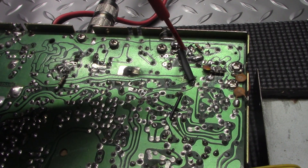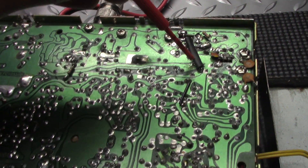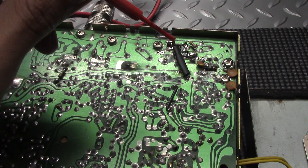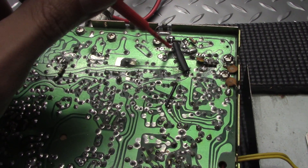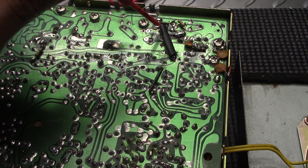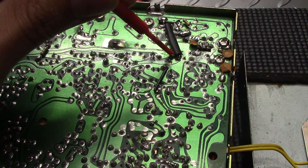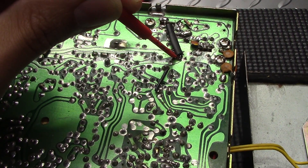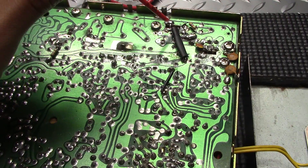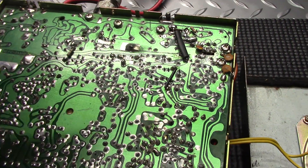If you're seeing like one watt dead key and you're not getting a lot of swing out of it, you're going to have to add this right here — an extra bias circuit. This is not in the instructions on CB Tricks or similar sites. It's a little trick I picked up along the way doing my own research. In order to get your gate voltage up and your dead key up, you run a resistor from your gate pin over here to an 8-volt source — which C116 has on the positive pin of that cap. I used a 10K resistor right here, and it came out beautiful — gave me my extra voltage and extra dead key.